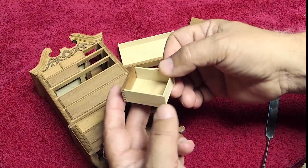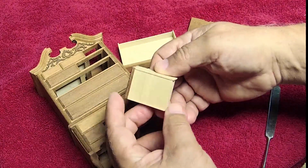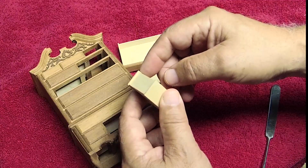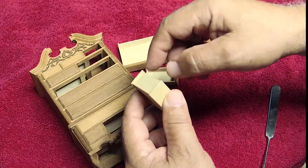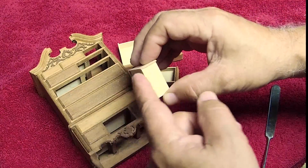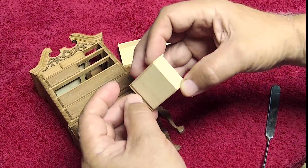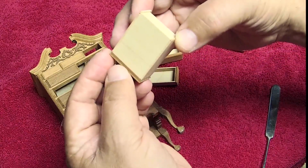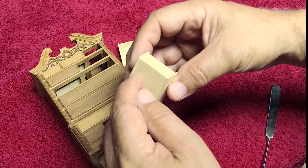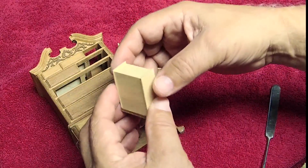Now, this is a typical drawer construction, and I really pride myself on my drawers. The sides have a dado. The backs of the sides have a vertical dado, and you can see that the bottom of the drawer basically slides through the little dado cut and mates into the dado cut of the front of the drawer. And in a real construction, this bottom would just simply be nailed in place, and that way it allows the whole drawer to expand and contract without cracking.